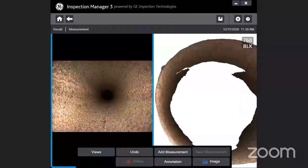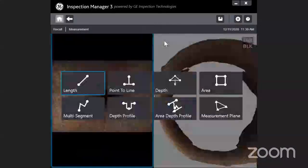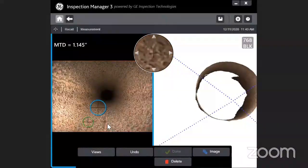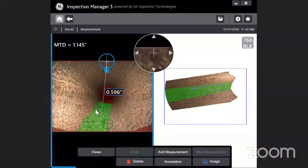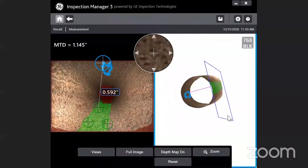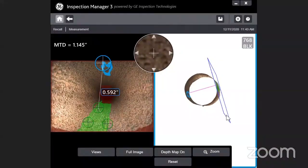What you need to do is select the feature — let's say depth measurement — and then place the cursor across the surface. These three cursors will make an imaginary surface on the tube diameter, and the fourth point the system will place automatically on the other side. On the right-side image, if you rotate, you can see the internal 3D diagram of the tube — something not available with any other technology. This can now be achieved very easily with the 3D measurement.